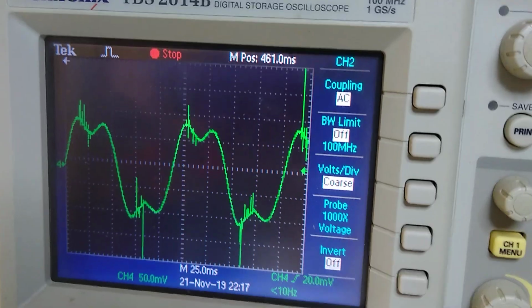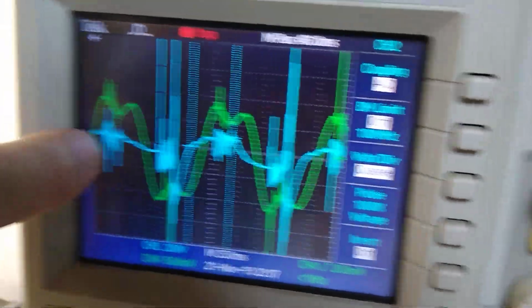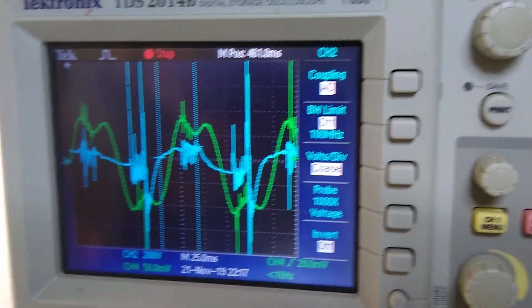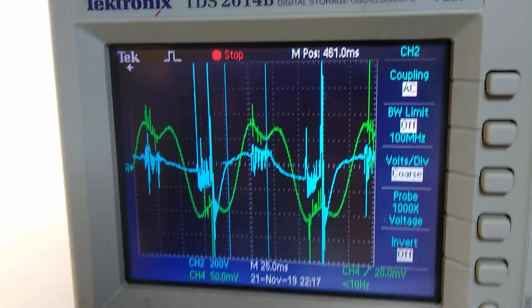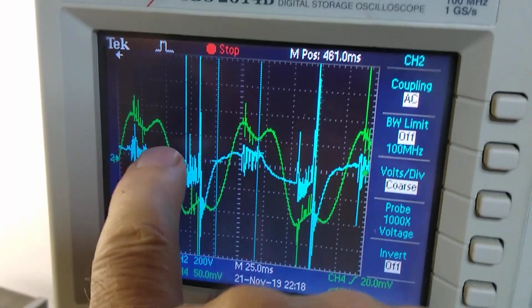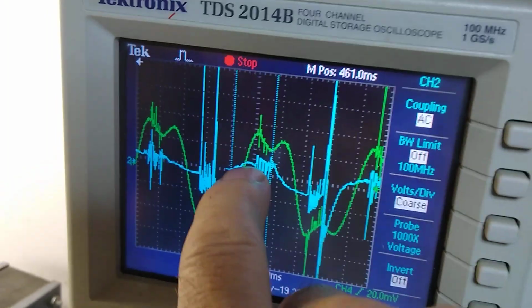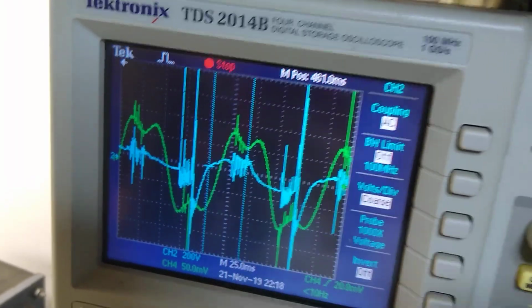Now I'm going to turn my voltage back on, and obviously this is 0, so my channel's set at 200 volts per division, and I'm using 460 volts. Okay, so this is where my commutator switches to one polarity and then off, stays off, switches the other polarity, turns off, stays off, switches to another polarity, turns off, stays off, switches to another polarity, and so on.